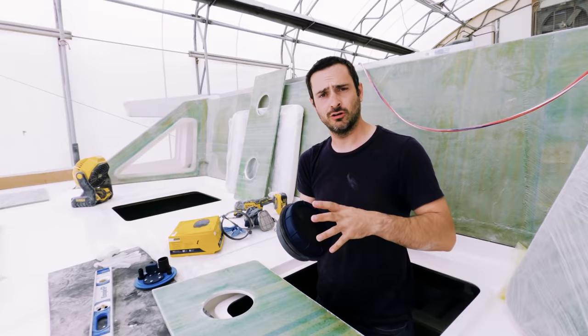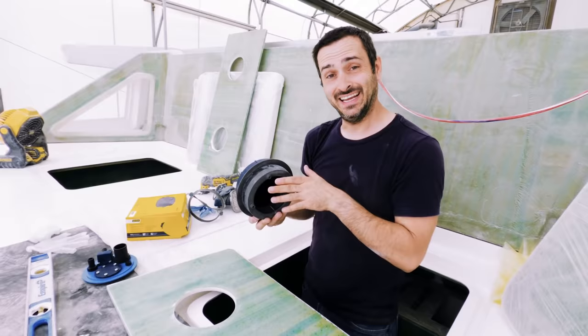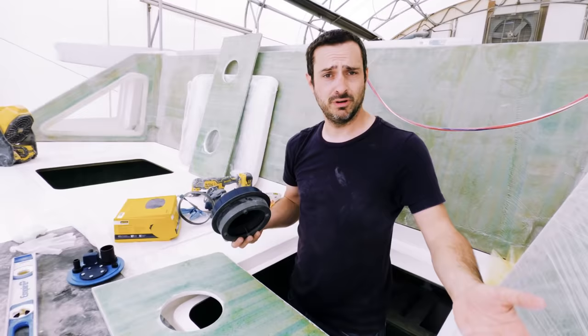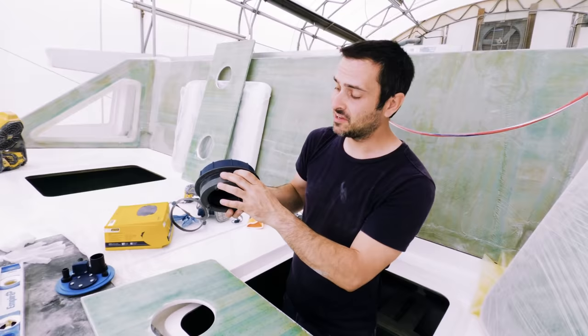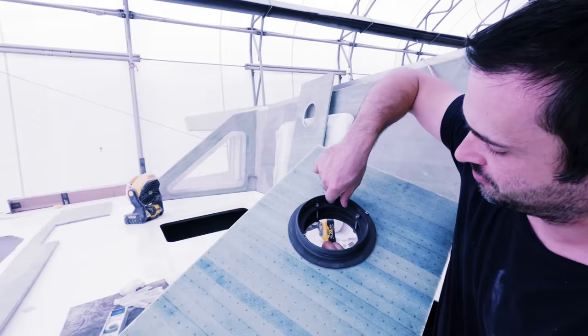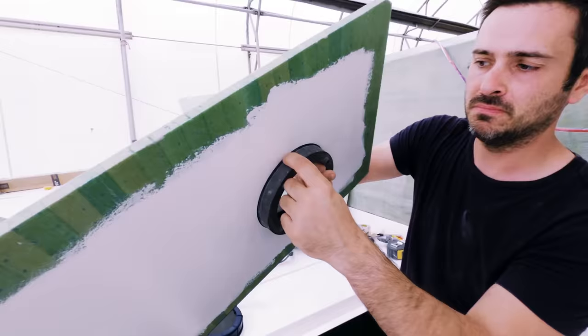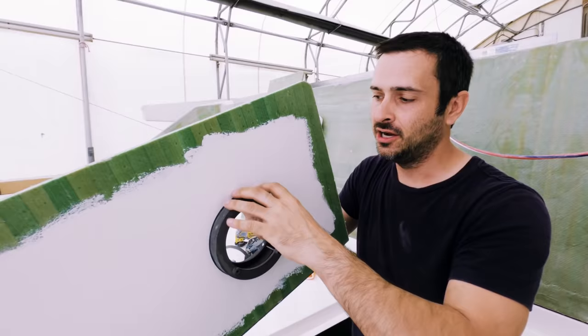Normally the way that these inspection ports work is you need to cut a hole in there, and then install the lower flange piece. Sometimes it's a hinged item, sometimes it's two separate pieces, or sometimes you actually need to do it before you enclose the tank in. The way Vetus has done it is they have this compression gasket. So you cut the hole to just the right size, then this item slides in. That's that fit in here. And then when you tighten these four hex heads, or the Allen wrenches here, that compresses and pulls this tight and actually tightens up that gasket. The gasket then spreads out and fills in and presses against, holding this whole thing into place, creating a nice watertight structure. Real simple, real easy.